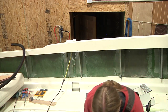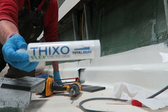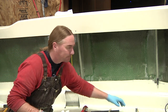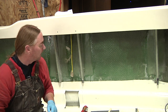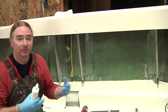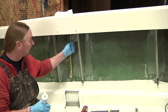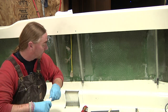Let's give this a quick wipe down and we should be all set. For bonding this in place, I'm going to be using TotalBoat's Thixo Flex. They also make a regular Thixo that would work perfectly fine here. My logic for choosing one over the other: areas prone to a lot of flex — and along the sides of the hull, the hull is going to flex a little bit running into waves — that's where I choose to use the Thixo Flex. But like I said, everything on here is going to be so solid — these knees are bonded onto knees glassed onto the hull — nothing would crack. I could easily use the regular Thixo, but this is what I have handy, so this is what I'm going with.